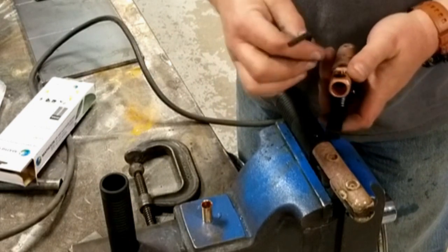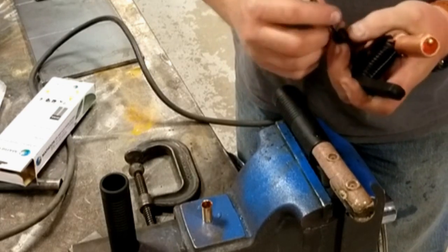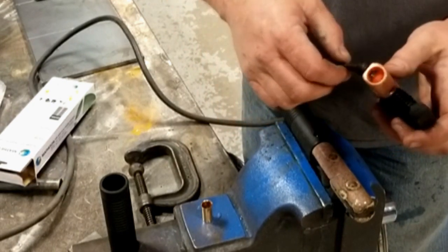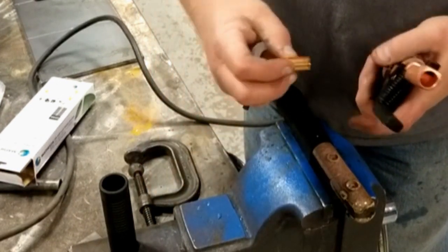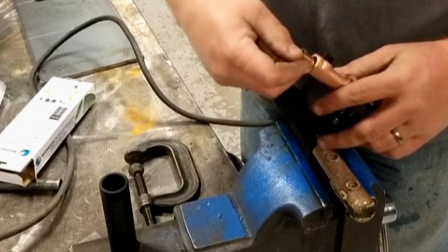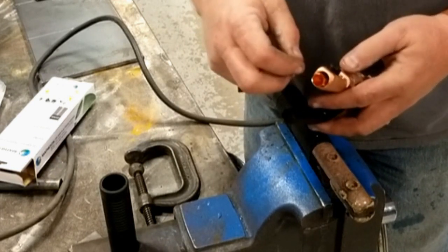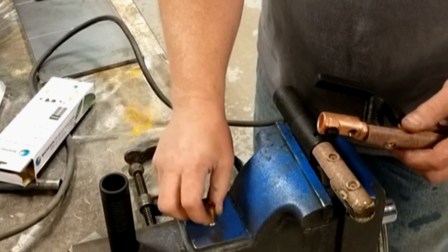Additionally in the tongs, we have another screw. This screw should have a radius on the end of it — we can see this right here in the camera. It has a ball end that will bite into the copper cable. I'm going to screw this back in just enough to get it started. You should have some sort of a copper sleeve — that sleeve goes around the cable to hold the cable together. This will actually bite into it and compress the cable, keeping the strands on the welding cable, which are very, very fine, from separating. Don't lose this part.